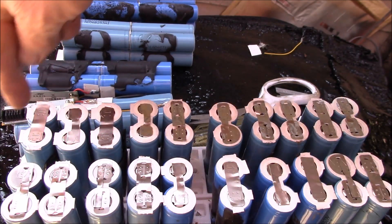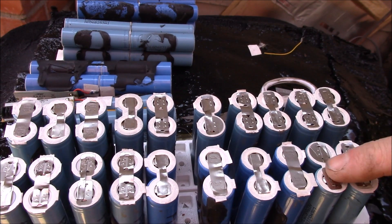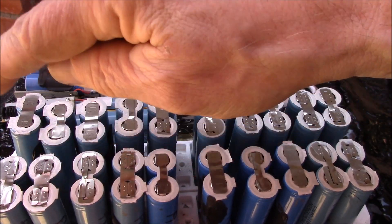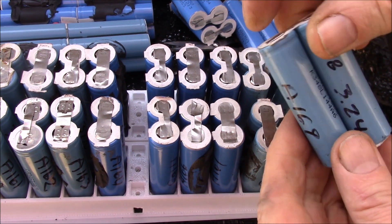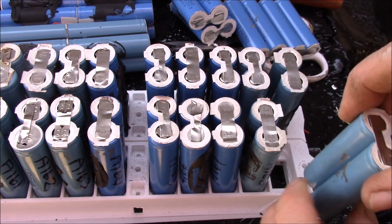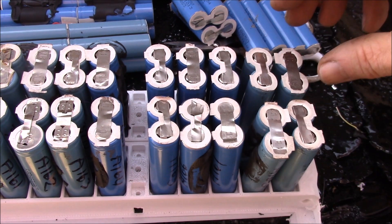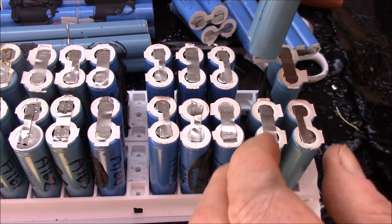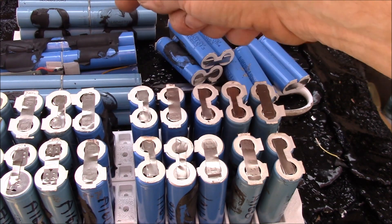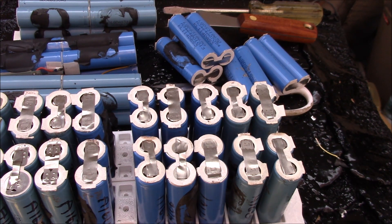Five of those modem batteries gives me 20 pairs, enough to build two battery modules. Here are the 3D-printed cell holders - I haven't separated them yet. Here's a group of already-tested cells: this one was 3.24 volts initial voltage, tested out at 3718 mAh. Groups of four test pretty similar - 3698, 3669, and 3675 - all within about 40-50 milliamp hours. If you have any feedback or experience with these, post in the comments below, and thanks for watching.